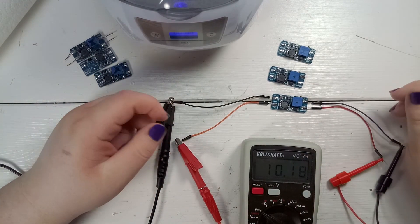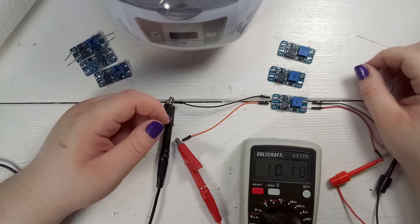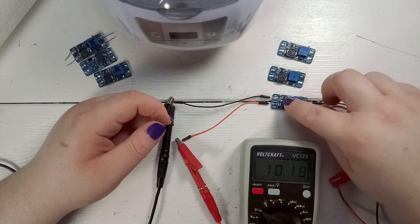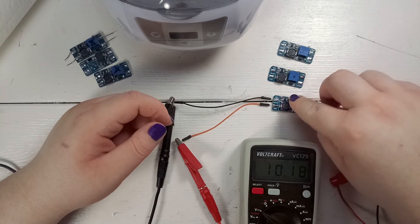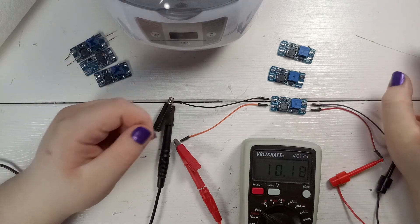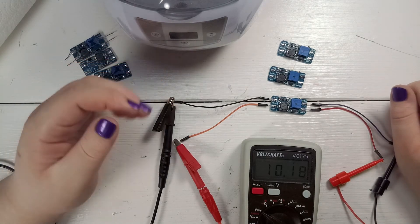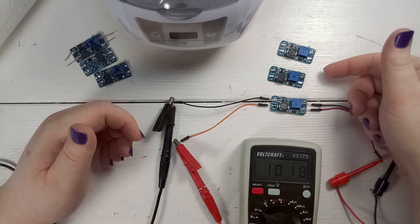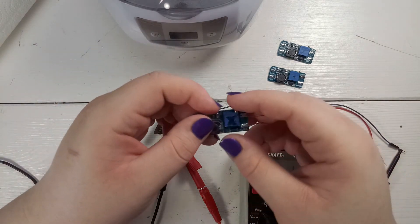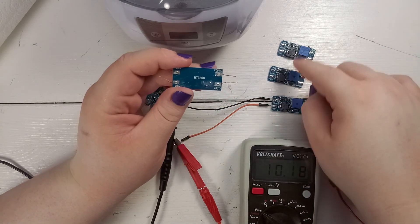This was a quick follow-up video about these modules, to show you what I found and what could fix them: either reflowing the solder joints, replacing the multi-turn potentiometer because it was driven beyond its boundaries, or measuring the small IC and making an electrical connection if the two pins are not connected. You can judge for yourself whether I was just really unlucky or if this is a common problem. Three of them are working after fixing, so it's not like there are damaged components — all the components on the damaged ones measure the same as the working ones.